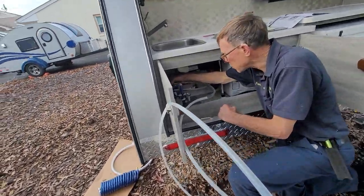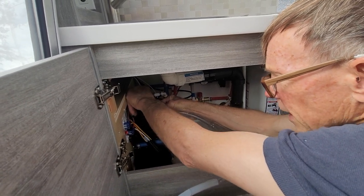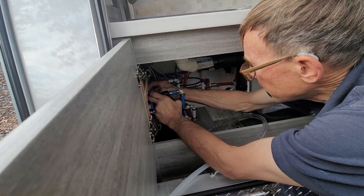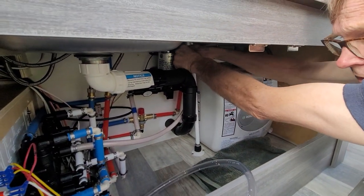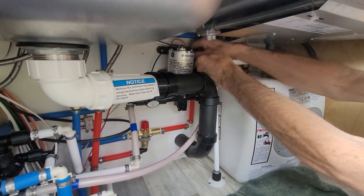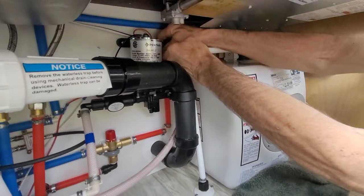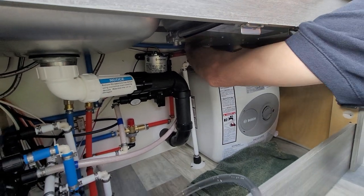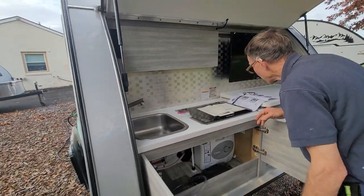Now I'm going to disconnect my hose from the blue water supply line, reconnect it to my Nautilus, and make sure it's nice and firmly tightened. Once I've got that tight, I'm going to go up and tighten the hose to my check valve. Then I'm going to shut off my hot water supply to my Bosch, shut off the hot water outlet to the Bosch, and shut off the cold water inlet on that tank. With both valves closed, I'm ready to move on to winterizing the Nautilus.